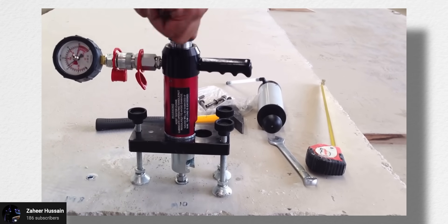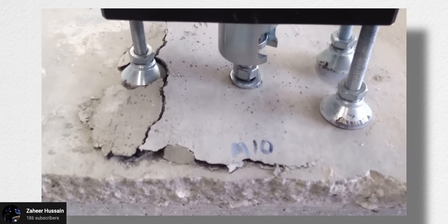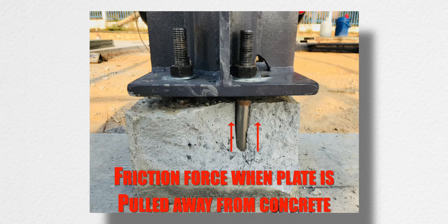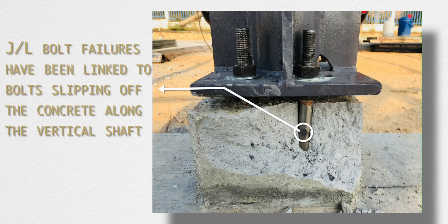Pullout is the ability of this thing to stay in the concrete without completely separating out of it. When we do that calculation, I can only use the part of this bar that would be in direct contact. You would also think that if I pull up on this, there's concrete around the bar that's in contact from friction — but unfortunately we can't use that friction in our calculation.